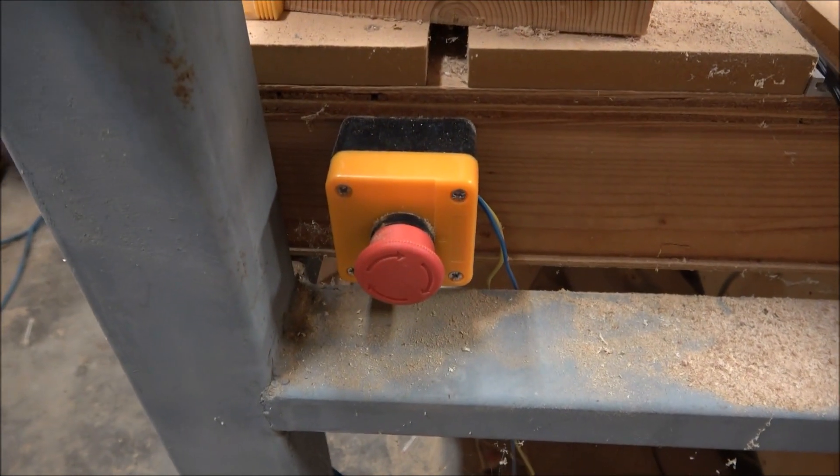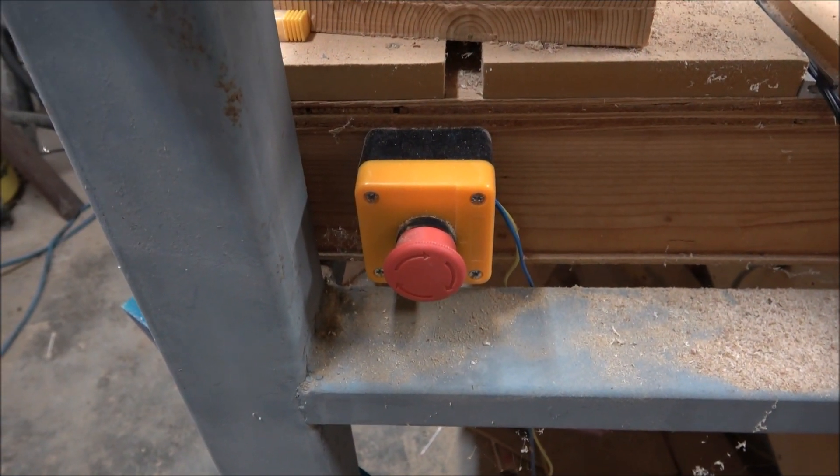Now I'm over here in the CNC room. One of the added extras you guys don't usually see is this little jewel right here — this is an emergency kill switch. If the machine messes up and just starts to do its own thing, which occasionally it does, the way that happens is when I'm trying to run the machine too fast and catch some drag — it'll start to skip and sometimes just go off the rails. You've got to be ready on the kill switch, or you could actually damage the machine — torque it and bend the rails.